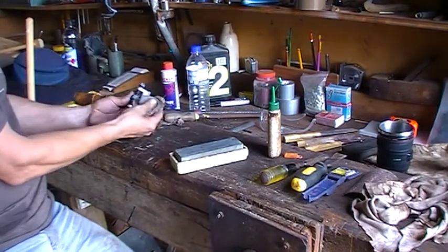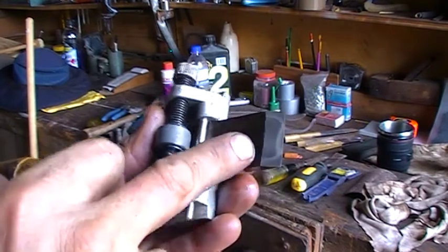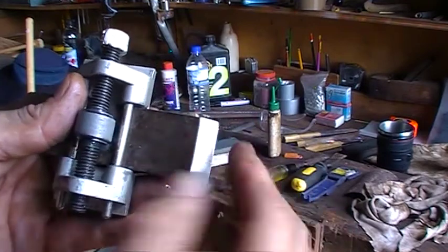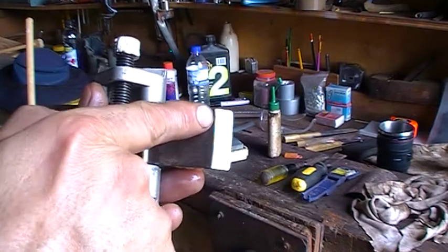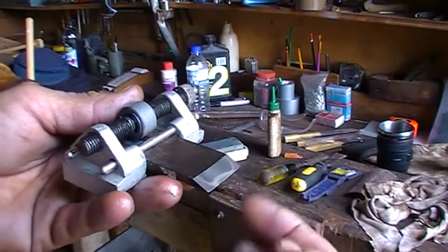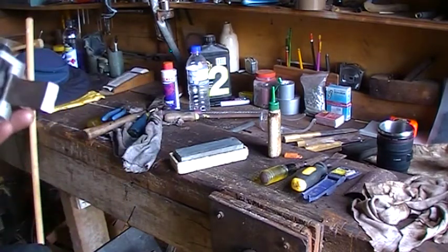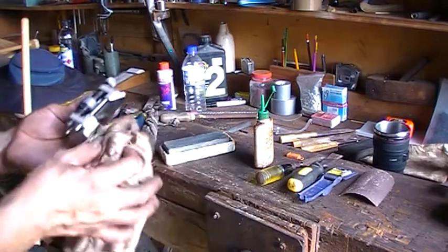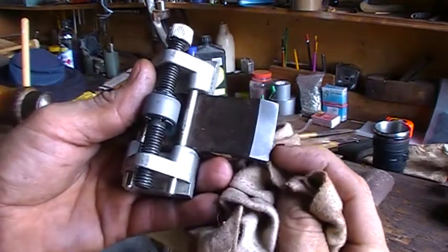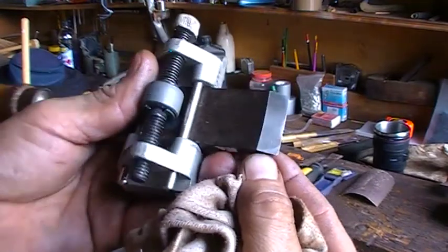How am I going? Let's have a quick look at it — yeah, it's not bad, it's coming up alright. If I pivot around you might get a change of light. You can see now because it's a flat bed it's really doing the centre — it's gone all shiny there. Those little dimply bits, just a little trace of them left on the tip. So I've done quite a good job. It's mostly straight across the centre; only the end bits are curved down slightly, indicating we are getting a straight edge back.